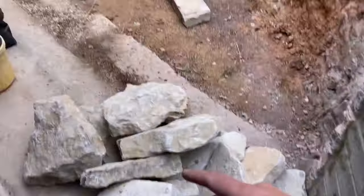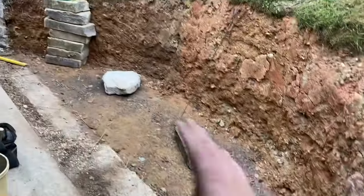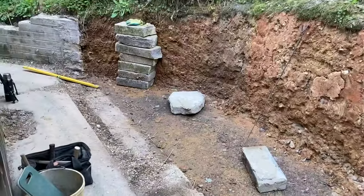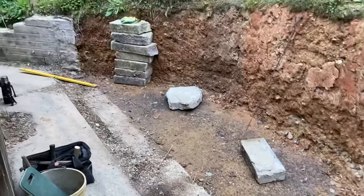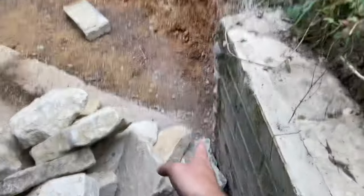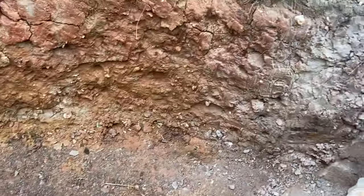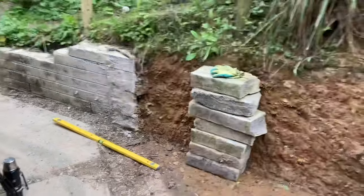Cam's just up there getting a load of stone down, get all the measurements up to make sure I get this curve perfect, because that's only been hand dug out. So I've got to try and marry up these points perfectly. Once you get your base ones in, you can just level up from them. So it's just taking into consideration where the wall's going to meet and stuff. Once I get these base stones in, I will be all right. So that's job number one. Let's crack on.